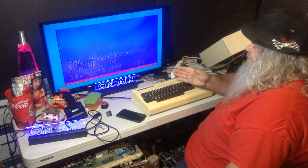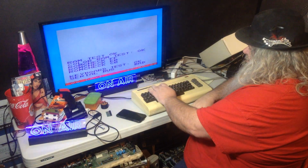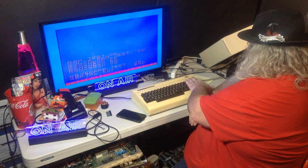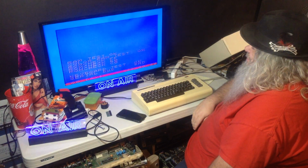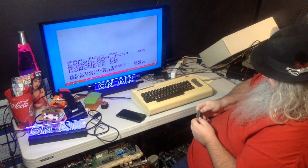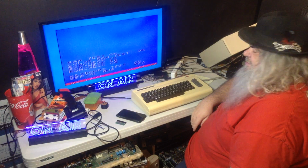But it's too bad that as soon as it finds something bad, it just stops. I wish it would carry on like the 64 dead test and report what it reports and keep on running. And I haven't found any way to convince it that it should ignore the error and keep on running. But it is somewhat helpful, up to the point that it isn't anymore. And I'm suspecting this little guy, which I found, which has a Commodore logo and also says 20, would be, if you didn't have a keyboard connected, that you would plug this onto the keyboard connector to make it think there was a keyboard so it could do whatever testing it was going to do, and probably tell you that the keyboard test was okay.